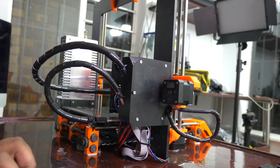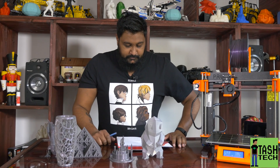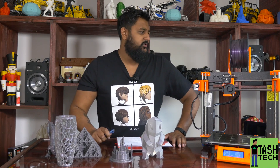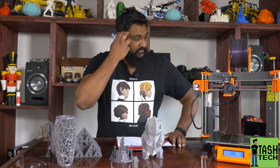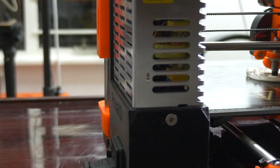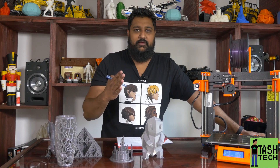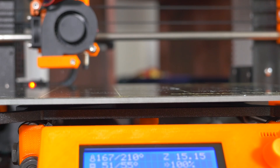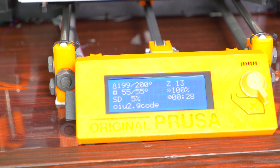For airflow, it's got a 3D-printed case for the electronics with holes for airflow, and it's sealed and very sturdy. The heater system is an E3D V6 original with a 12 or 24 volt, 30-watt heater cartridge. The power supply is mounted on the side. The printer is so sturdy that while it was printing I actually picked it up and put it on the floor and it just carried on printing. I've not had to bed-level anything - I built it, leveled it once, ran the calibration with the PINDA probe, and it does it itself every time. The LCD screen and knob input all work perfectly fine.